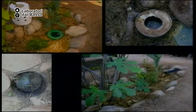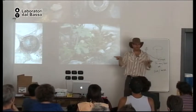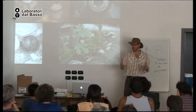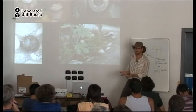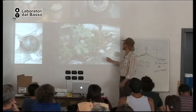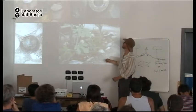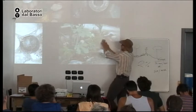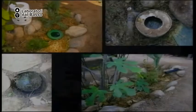Ugh, it's awful. Okay. So what could we have done to reduce that problem? Yeah. We could have made more splits. Okay? That would have been great. But we had the option of raising the pipe and making it above surface discharge. That worked too. So now the water could go to the whole basin, not just a small section of the basin.